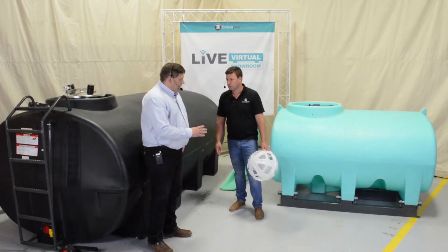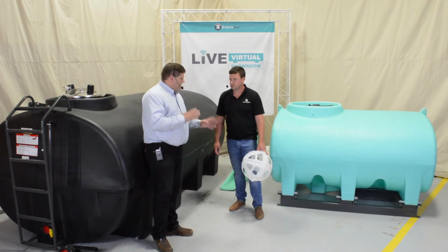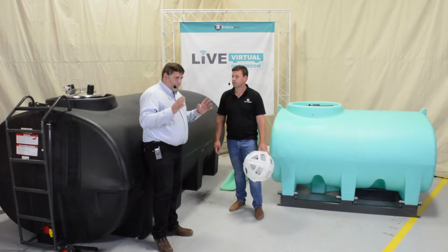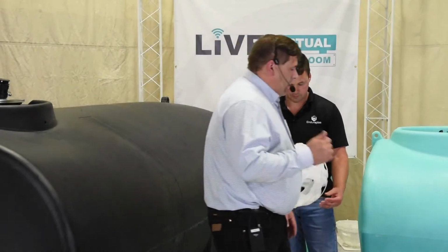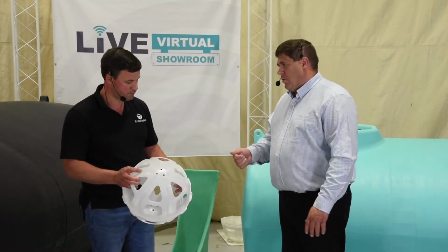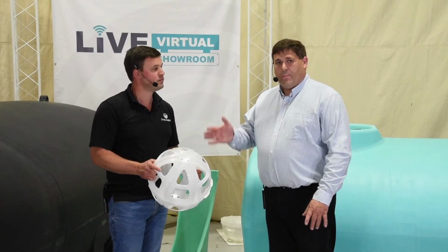So now I'm going to give you my opinion. And I agree with a lot of the points Mike made there. As far as stability goes, yes. If you're hauling water or hauling the same fertilizer day after day commercially, yes, that's the right way to go. Now, if you are hauling hot mixed liquid chemical, or if you're changing brands of fertilizer, or if you're doing anything like that, then I'm going to tell you, no, this is not the right way. Then you should go with the upright baffle.